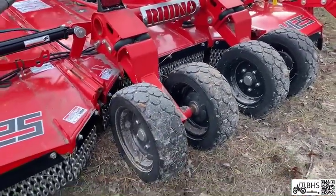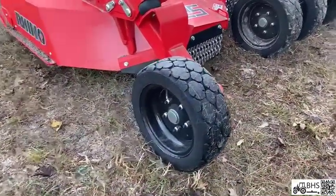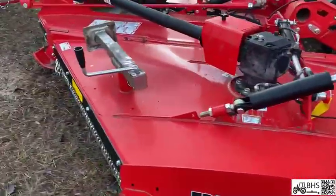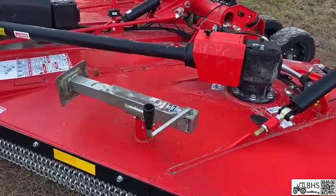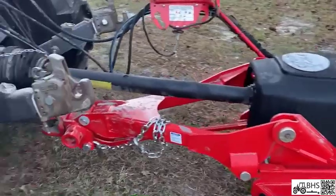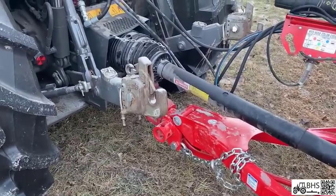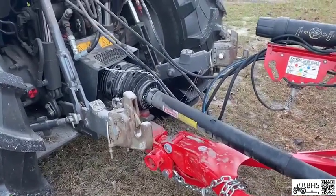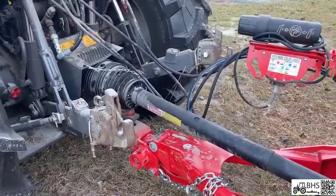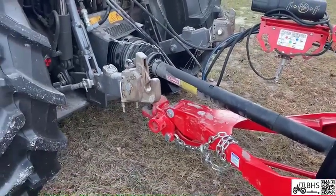This has got the top-of-the-line tires on it. Obviously they are not going to go flat, and they've got a little tread on there for traction on hillsides. It comes with a jack stand — I'm a little concerned about that handle getting bent and ripped off. The lower lift arms and quick attach tend to get in the way a little bit when you're trying to really turn around or make a hard turn. You've got to keep an eye on the hydraulic hoses to make sure they're not getting caught, or that you don't turn with the mower up higher than usual.